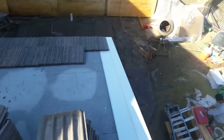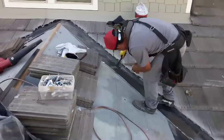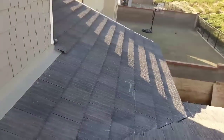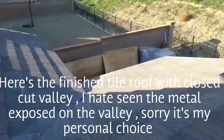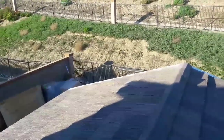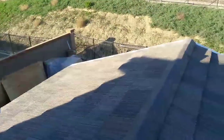This is a new idea for the rake from the flat tile. This is a finished roof — it has one layer of the Class A fire rated underlayment cap sheet, 40-pound felt, and also these guys came out with this idea to put a tile pen on the edge along with the coping metal — like a little coping and a tile pen together. It looks nice. I've never seen it finished like this before.